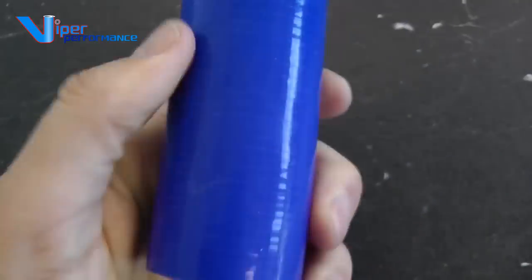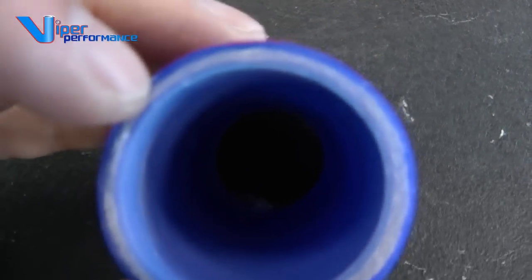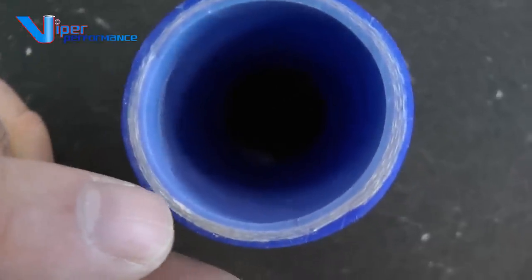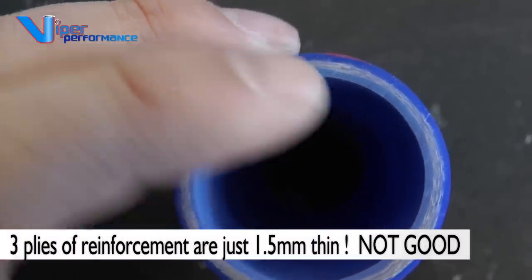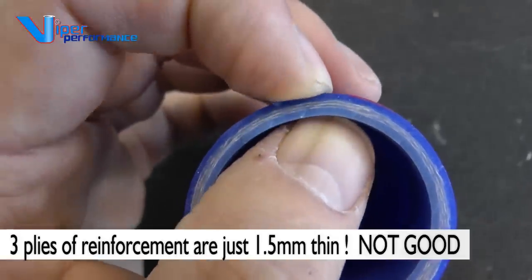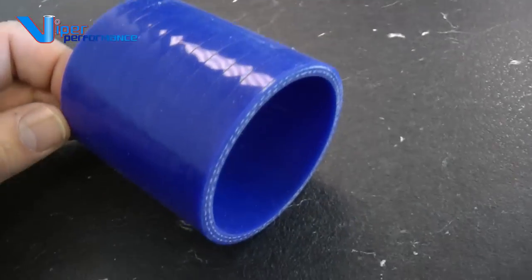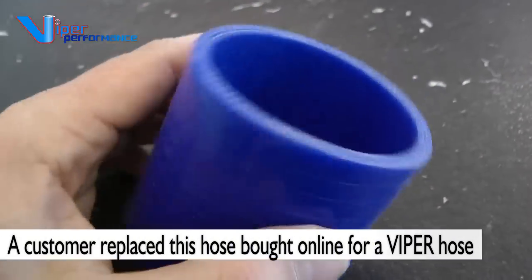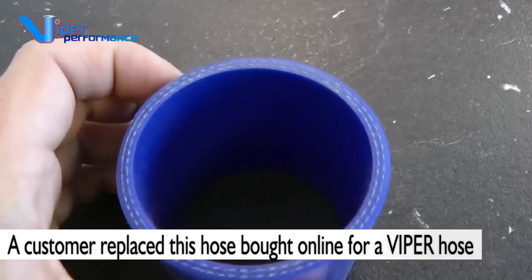This is a very soft, nice glossy material once again. On the surface of it you can take a picture and buy this on an auction site and think, yeah, this is a bargain. But really the fabric in here is completely not suitable. Each layer is extremely thin and the overall wall thickness is really not adequate for this sort of hose. The burst pressure on this is likely to be extremely poor. This is a lovely hose to look at — very glossy, very shiny, and a nice colour pigment. This is a 70mm diameter hose and a hose like that should never be built with just two layers of reinforcement.